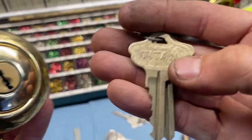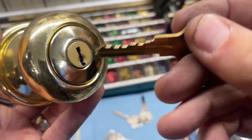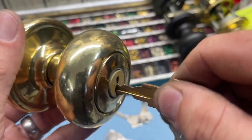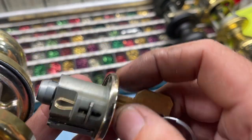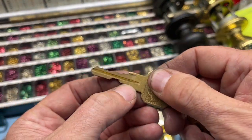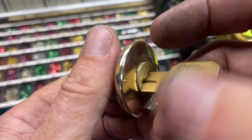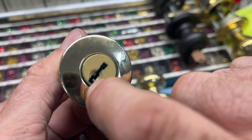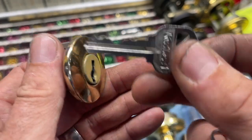We're going to do a cheat. So again, you have the keys that actually, this is not the keys. Here's the cheat. So, key that operates it, right, left, right, it's fine. And then one with a notch cut in the bottom, return it, and look at that, it slips right out. But the point of me showing you this right now is I'm going to have this out when we get the other one out, and we're going to see kind of the problem with old Titan where they've been really heavily used. This bottom part right here is very important as a stop, and what happens is from people slamming the key in over years and years, that bottom stop gets worn out, and if you ended up having to key one of these to it, it's going to throw off the key.